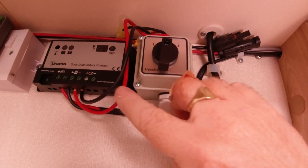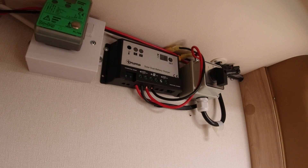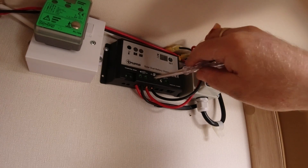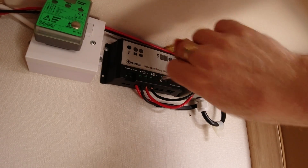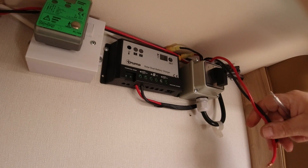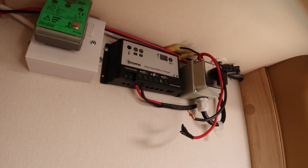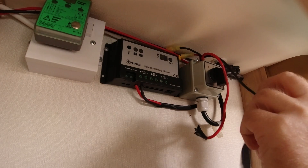So I can disconnect all these and it won't make a lot of difference, and then I can tidy it all up. I've just realised the battery's still connected, so I think for now I'm going to leave the battery connected. I'm just going to take the solar panel wires out, which are actually a lead from the switch to the solar panel, which is in the off position, so it's quite safe. Just for belt and braces I'll put a bit of tape around them. The other thing I've got to do, which I haven't sussed out yet, is find a ground earth in there for the new solar controller.